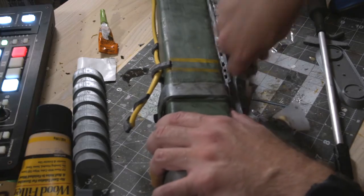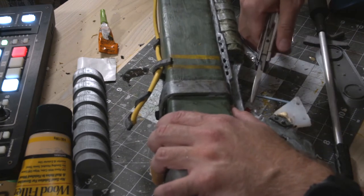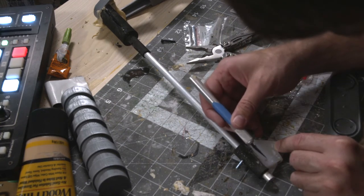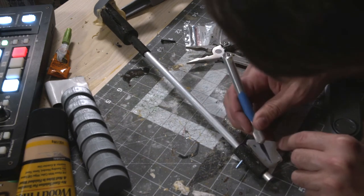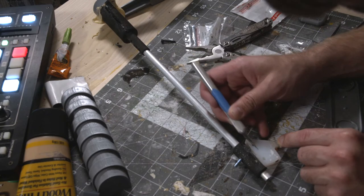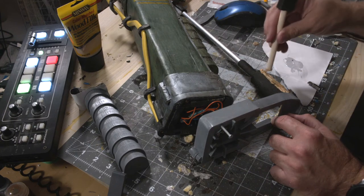At the opposite end of the aluminum rod I have a plastic piece attaching it to the main body. This is not 3D printed — it's actually UHMW, ultra high molecular weight plastic, basically what's often used as robot armor. This is important because once again, if you've got a very large thin piece, 3D printing tends to snap, whereas a solid piece of UHMW will not, making it a much better structural component than thin 3D printed parts.